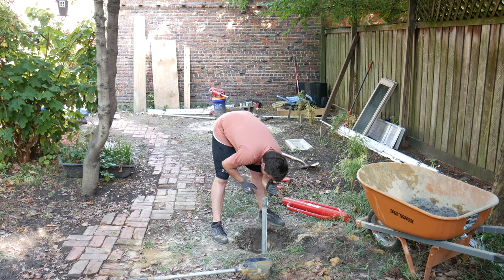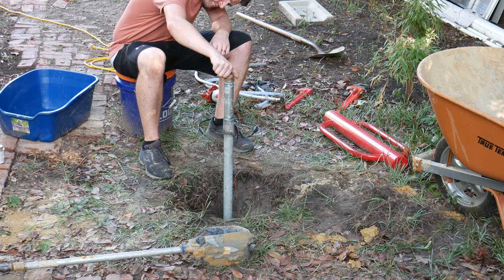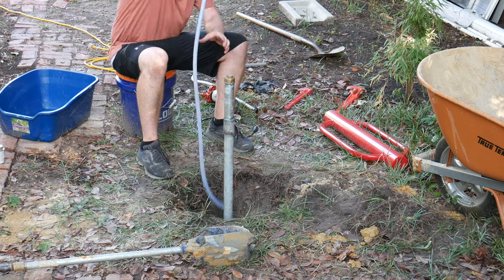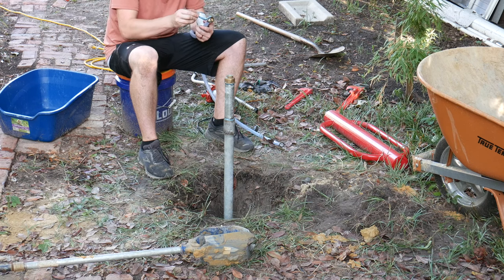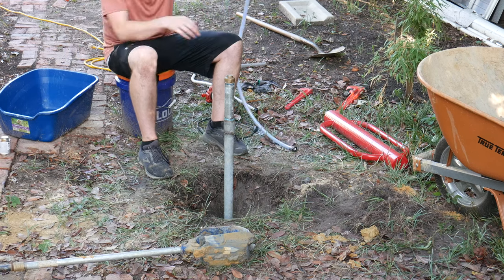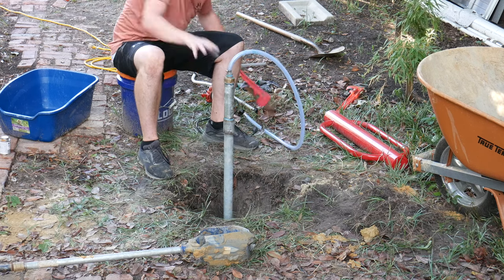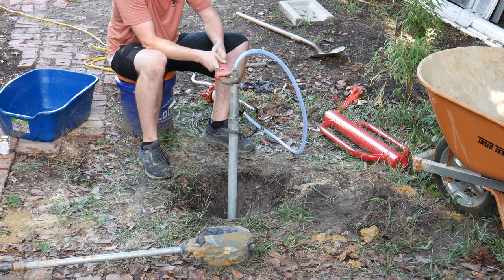This depth produced really good results. Here I'm going to hook up a small pump to test out the water flow — this is the same pump I used in my other video about the rain barrel to pressurize the rain barrel output. I'm putting thread seal on the threads on this inch-and-a-quarter pipe. I've got an inch-and-a-quarter to three-quarter reducing coupler and a hose with some hose clamps as an adapter from the inch-and-a-quarter pipe to the half-inch inlet port on this small pump. We're going to connect all this up, then plug the pump in and see what kind of water we get.